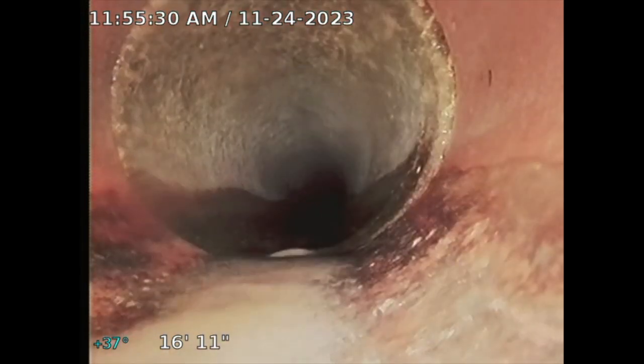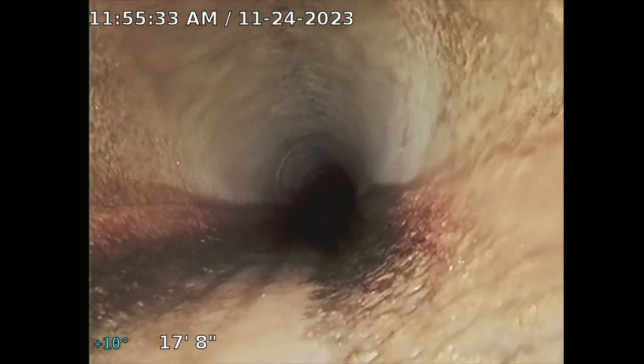Alright, so we are ready to clean that section of the locked pipe. Now I'm going to try to access the main sewer here. Let's see if it goes. I have some water collecting there, but it should be fine. Now this is clay pipe, and that's telling me the clay pipe is outside of the property, not underneath — because they don't really do clay underneath the house.